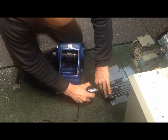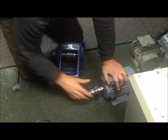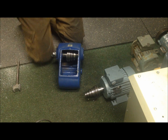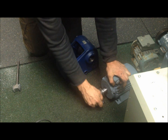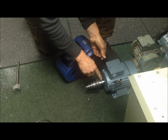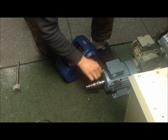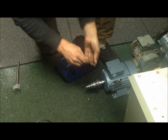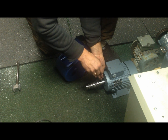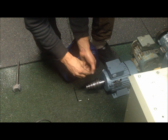A little bit on the tight side, perhaps. And the stop screw goes underneath here. I didn't want to mill a keyway on the inside of this — it was a maximum of 28mm to go through the slot here, and I think it would be too shallow to put a keyway there. He suggested just putting a stop screw there, so I just tighten this. I think this is the start.